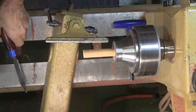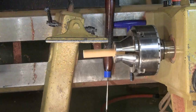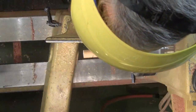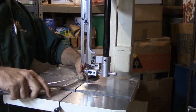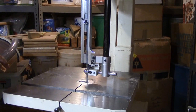My initial plan for the posts was to mount the dowel on the lathe, drill a center hole, cut the vinyl cover, and part off the posts. This quickly evolved to leaving the cutting of the vinyl covers to later. A little CA glue locks the vinyl in place. A better plan was to cut the vinyl on the bandsaw. Even that had its problems.